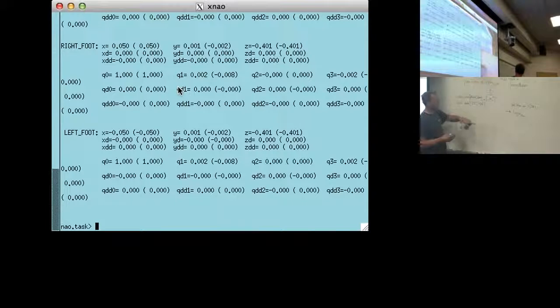So from this variable, you get the target for the COM, the center of mass. You get the center of mass position from us, which is literally calculated the same way as you had to do it in your homework assignment. You basically sum up the center of masses of all links divided by n. So the positions, of course, and you get the average of everybody. And then we have to create a way to get to this position.